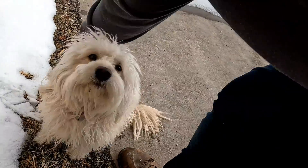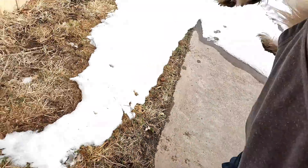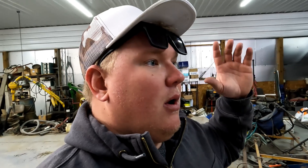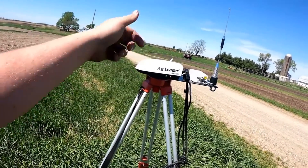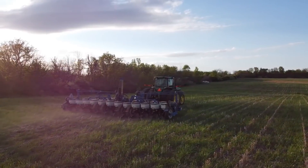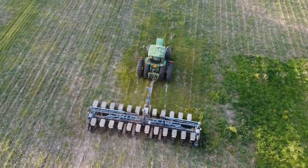I was actually using my RTK system for the tile plow at the beginning of the year until the TerraStar X system arrived. I don't think I used it at all to plant corn, but I did get it put onto the soybean planter. Obviously the correction level is higher and better, but what I noticed during planting season is that when you're using a base station you have to move it to the field you're at, have its location set up, and that takes time plus more gear to move. When I was using TerraStar X to plant, I had sub-inch accuracy wherever I went — it was quick to load up, fast, didn't have to move a base station around. It worked really, really well, so much so that I will pretty much be planting all of our crops next year using TerraStar X. I trust it that much.